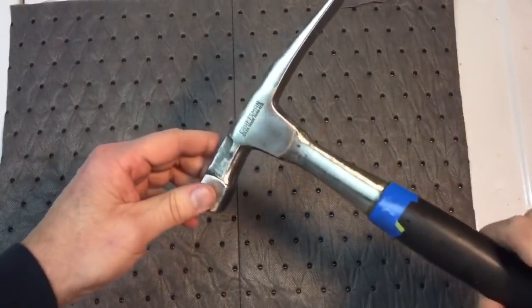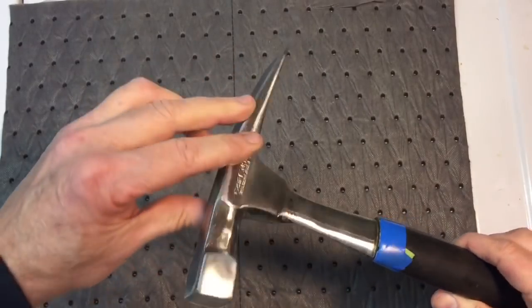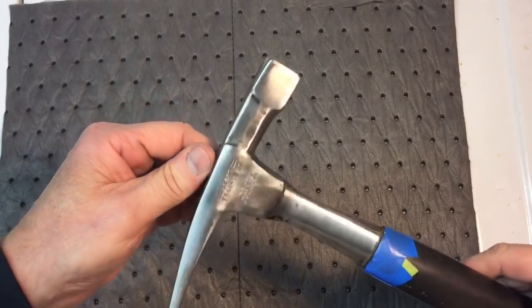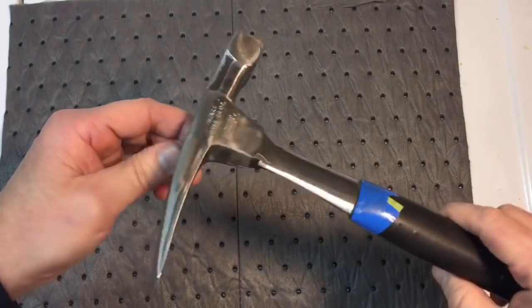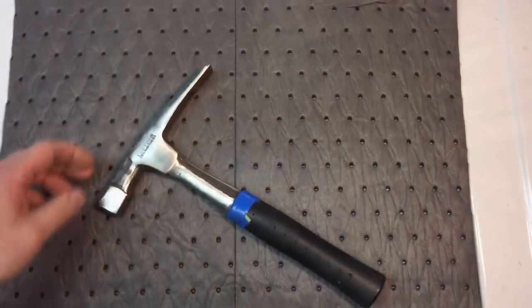Now we finished with the belt sander, and this is the finish you get from a belt sander. We went, as you see, through the different belt grades. It looks good now. Now we're going to take it to the buffer and get out all this, and then we'll paint in here. Almost done.